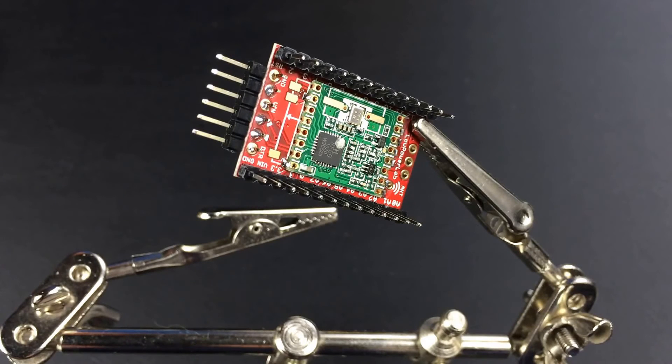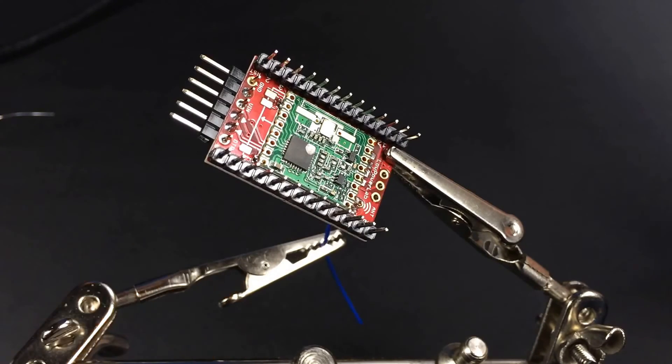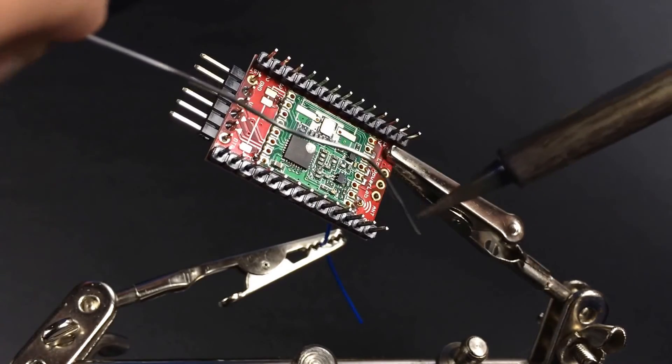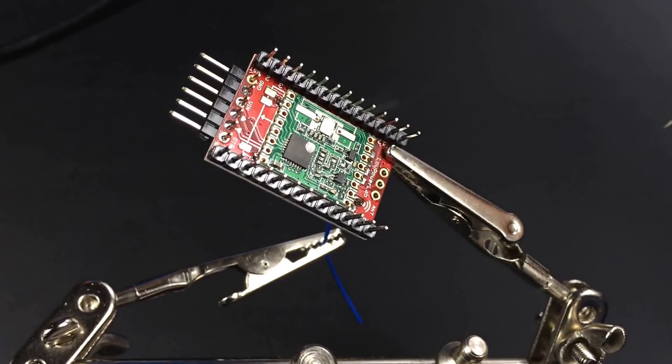So I put it on the other side and from below I'll push through and solder onto this antenna. I like to use a pair of helping hands — as you can see, these alligator clips make it really easy. I've got the antenna wire hooked up and using this other alligator clip with the helping hands, it's holding it in place and this is holding the board in place. The antenna wire is just sticking through that little antenna symbol there. All I have to do is dab it with a little bit of solder to get that thing attached, and then our wire antenna is attached — just like that.